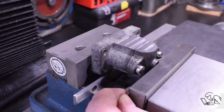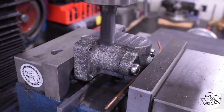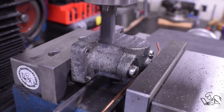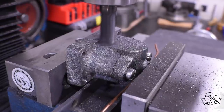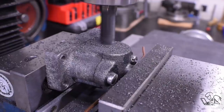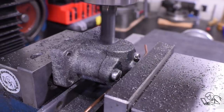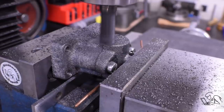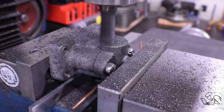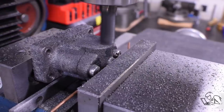If I do that, then the bearings will be sufficiently aligned, and if by some freak chance they weren't, you could always shim one or the other with a half thou or one thou shim - but honestly that really won't be necessary if you do an edge find carefully. This setup is much simpler, much more rigid, and I can do some other operations while I'm here. So now is the time to finish these side faces down to final dimension. I left them oversized, and that's because I wanted to finish them with the parts bolted together as you see here. I measured how much more I had to remove to get them to the right width, then I'm taking that same amount off both sides.